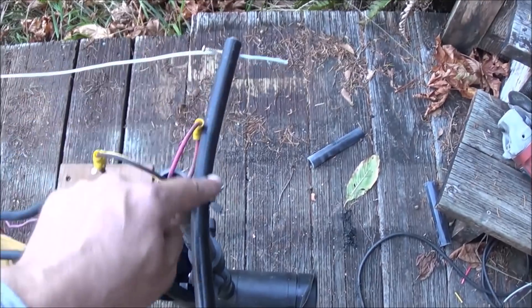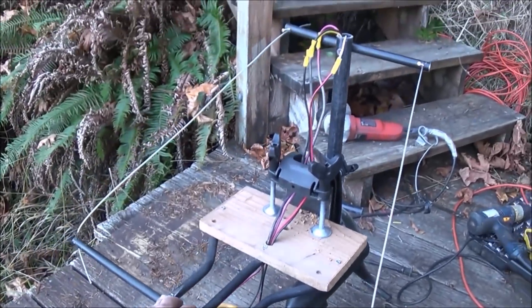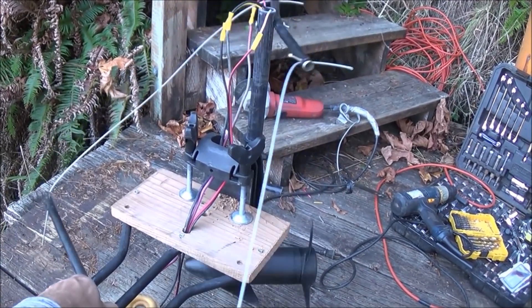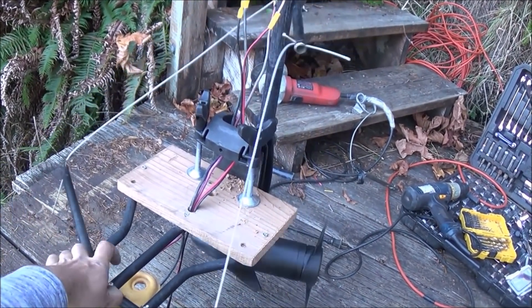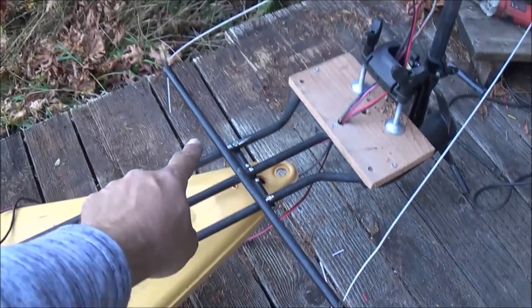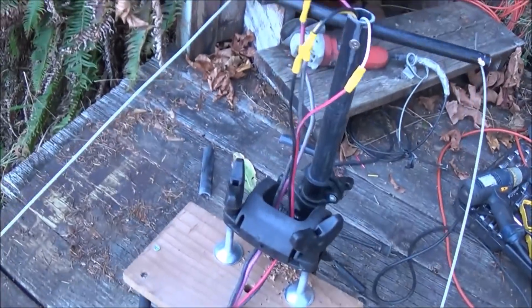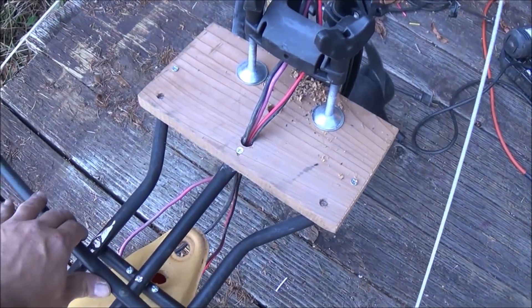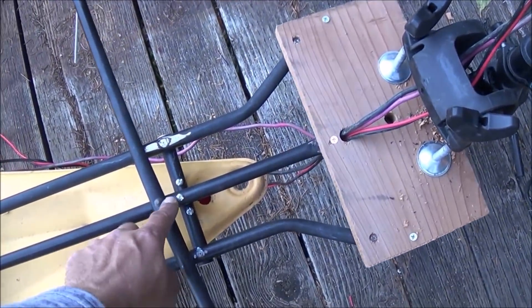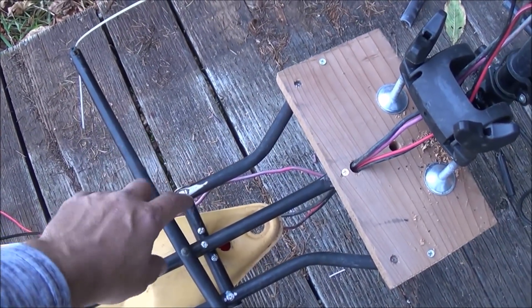This arm is 12 inches overall length — six inches from center out to where the cables hook up. You can see that going down into this arm. If I actuate it you'll see how it's turning the motor. So that'll be our steering system going back to the motor. All we have to do now is run cables off of this piece, up underneath through the sides, and to our foot pedals. When we push down on a pedal that pulls on the arm and turns the motor in that direction. It's a very simple piece — already from the chair. I might shorten it down a little bit so it doesn't go all the way out to the end. We'll see how hard the torque is once I get the pedals attached.